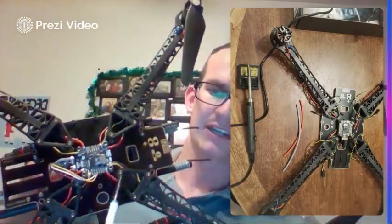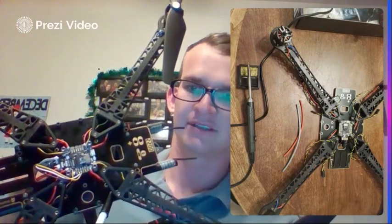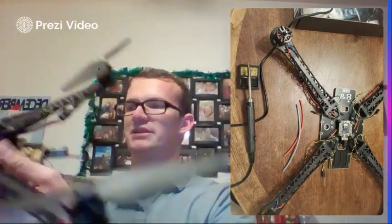There we go. Solder and connect those little extenders to your ESC wires. So strip those to help get them prepped, intertwine the wires, and then solder them together. And then you'll want to put some heat shrink on that, as you saw. Tighten that up, cover it, make it look nice, and keep it safe, and avoid any kind of issues in the future by protecting that properly.